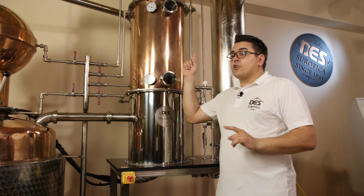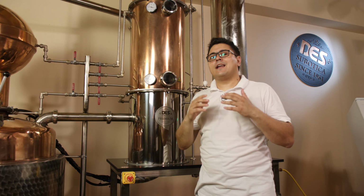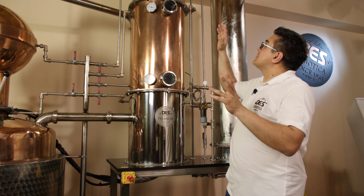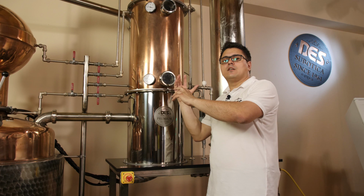After the vapor reaches the end of the column, it passes through the deflegmator. So, that provides initial condensation of alcohol steam and it separates higher alcohols, water, and other heavy or high steam point components from the ethanol, the only alcohol you want to drink. It does so by regulating the temperature of the water in the deflegmator itself, and when a stable temperature of exiting vapor is achieved, it's approximately 82 to 85 Celsius, the water, higher alcohols, aldehydes, esters and ketones will condensate into a liquid, aka reflux, and go back down the column interacting with coming vapor.